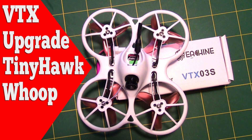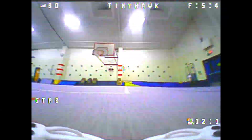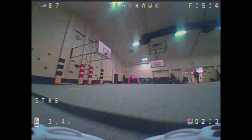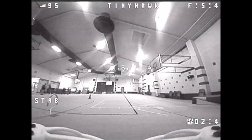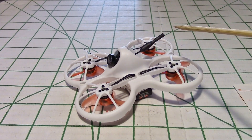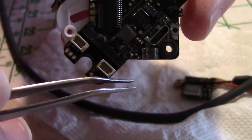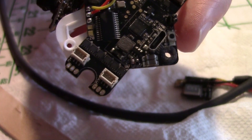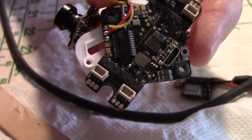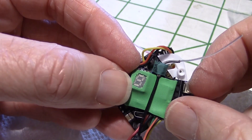I really like my Emax Tiny Hawk Racing Whoop. It's a great FPV whoop racer and I've had a lot of fun with it. There's just one thing I'd like to improve on and that's the choppy video feed. Luckily the Tiny Hawk has been around for a little while and there's lots of feedback from pilots on RC groups. I tried some of the early modifications that were suggested such as bringing out the video antenna, removing the heat shrink from the antenna, or adding capacitors to the 5 volts or 3.3 volts. My Tiny Hawk had one of the newer revision boards that already had the capacitors added, so I knew it wasn't the cause of the choppy video. After reading some of the comments on RC groups it became evident that the best approach was to replace the video transmitter.